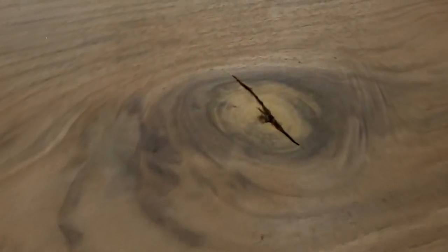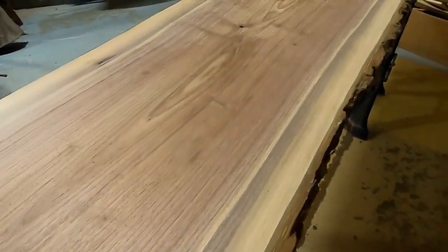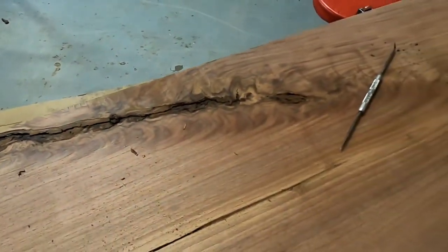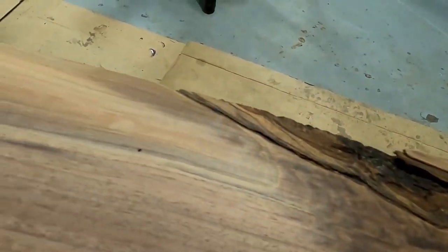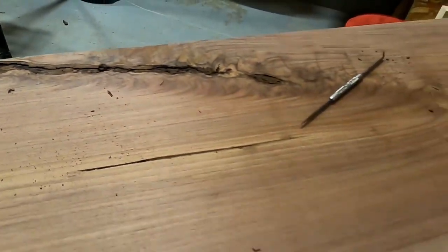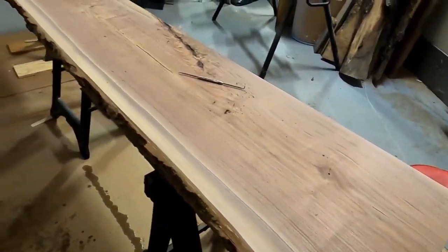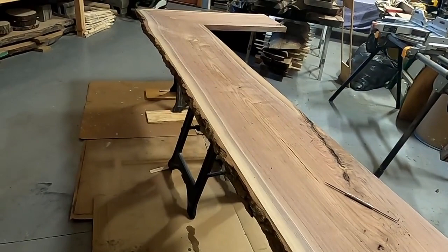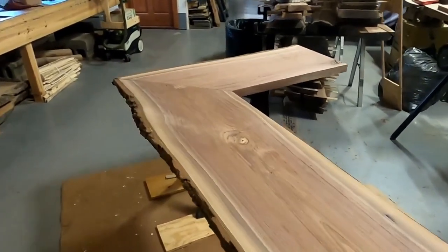This particular knot with a crack in it is kind of soft, but the epoxy should harden that up and it'll be perfectly fine. The coolest feature of this entire slab is this bark inclusion — it's just huge and it's going to be awesome filled with ocean blue metallic epoxy. We have a couple little divots and holes that we're going to have to remove some of the bark and loose materials from, so we can fill all the voids with an ocean blue metallic and finish the whole thing off with an epoxy finish that lays right out like glass.